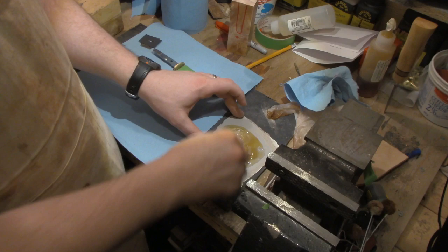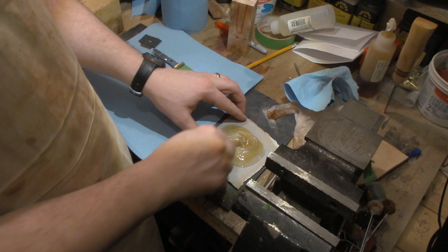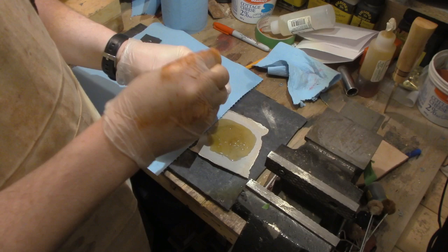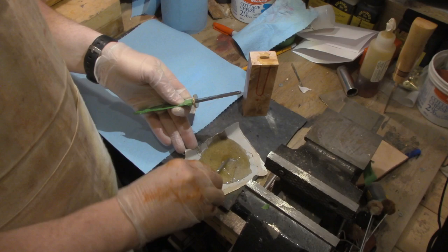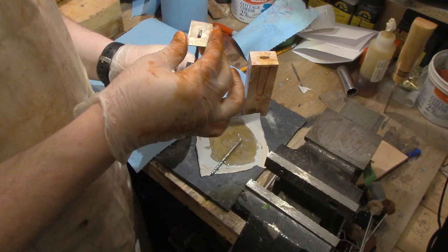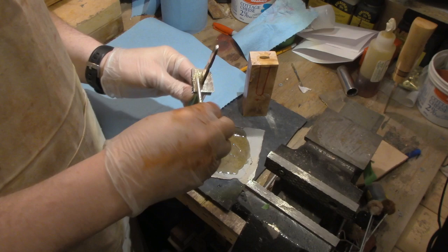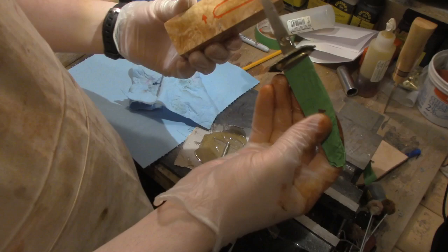I've shared on other videos how I like to use golf shafting epoxy — it works really well. I have not had one knife fail. I had to cut a knife apart one time after it fully dried, and man, that epoxy was hard — really good stuff. Then you just begin stuffing the hole full of epoxy. The tang hole is all filled with epoxy, and now I'll get the epoxy on the guard and get the glue all there. Next comes the little piece of brass. Push that all together, then the final bit of epoxy on the last piece — obviously very good to use rubber gloves for that procedure.